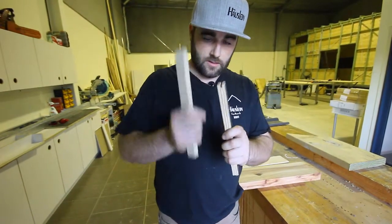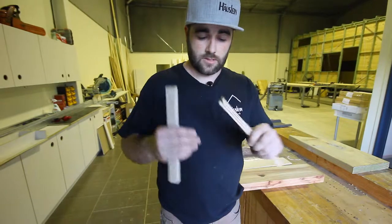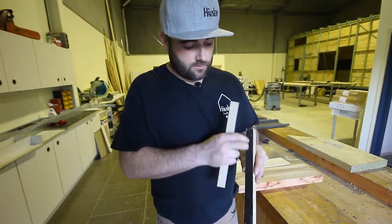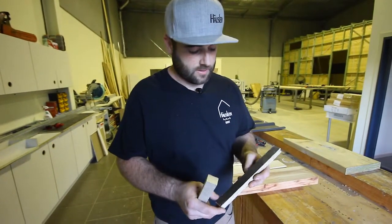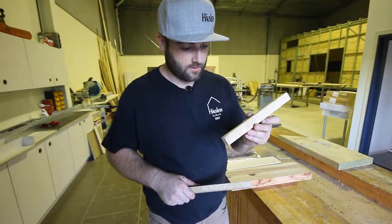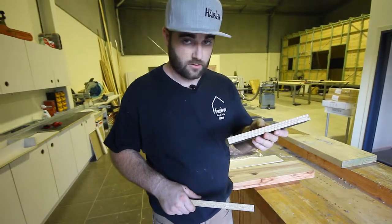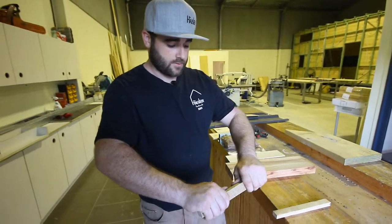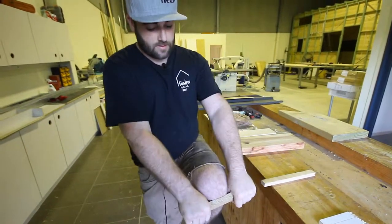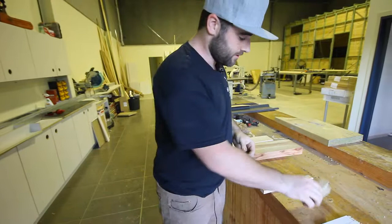What we use in the truck and tiny house floors is a plywood floor product. You can see there's a tongue on one end and a groove on the other — they slot together and come in big 2.4 by 1.2 metre sheets. We paint the bottom with a bitumen product for an extra seal. This plywood is naturally a lot better in the wet because there's a lot less synthetic processing done to it. Now the chipboard — pushing quite hard — I can break it with my knee. Not too bad, but there you go.